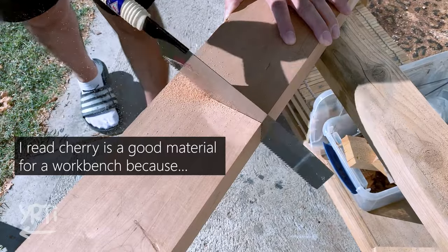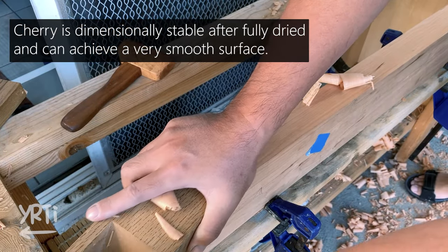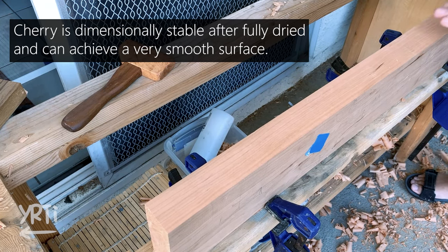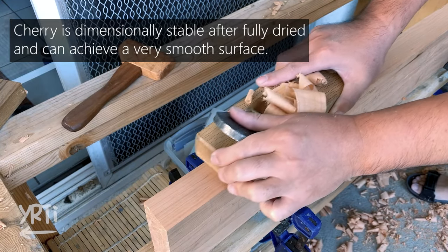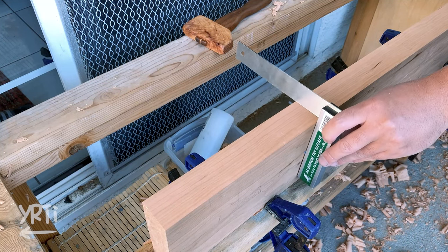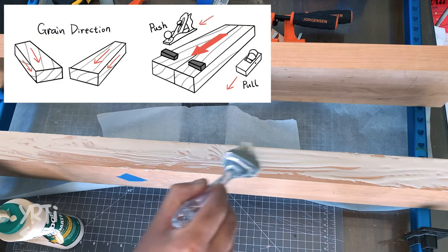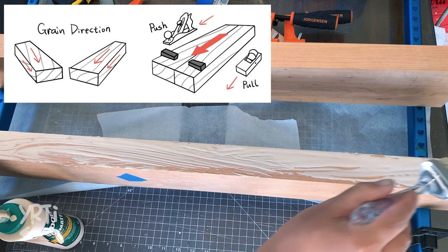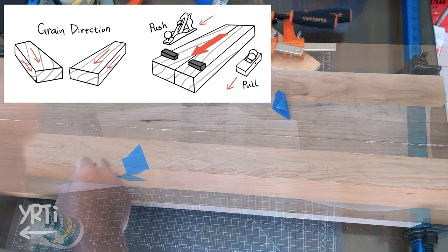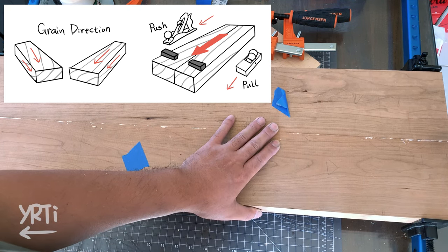I got this cherry and, as usual, I prepped the wood by hand tools. It's partly because of my incapability at hand planing, but it was so difficult to join 33-inch long boards nicely with my 12-inch straight edge. Then I joined two pieces of wood. Since I wanted to use this as a planing board, I set the grain orientation like shown. In this way, it's not only easy to correct the surface, but I can go with both push and pull style planing with the bench, and there is less chance of tear-out by accident.